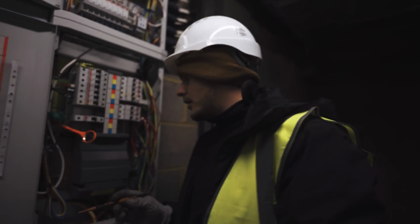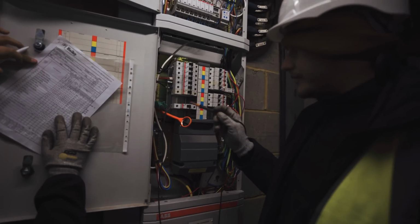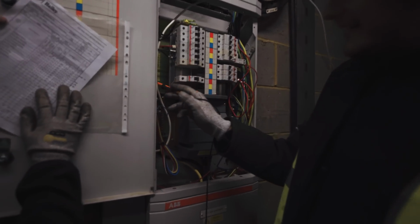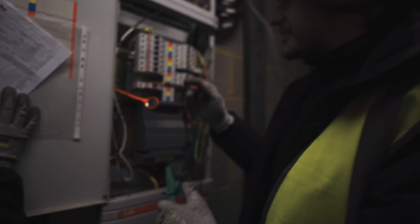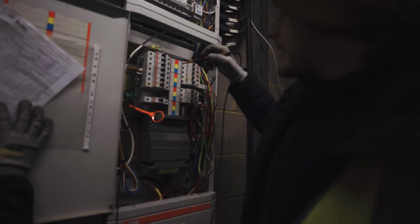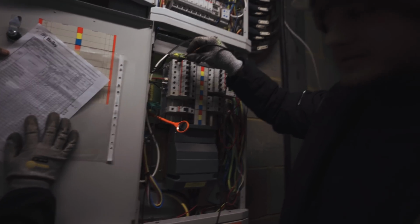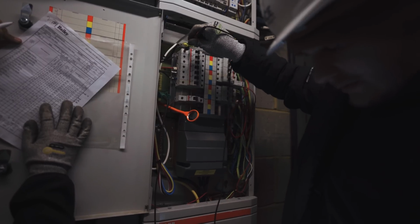For now, just to prove the cabling, I've isolated the board, I've disconnected the earth and wedged my mirror between it, because it's got a bit of pressure on it. It would touch the casing and basically give continuity still. So I've wedged that in there. I'm going to bang this on here. I'm just going to run through basically one by one. Not doing live to live because all the loads are connected, but live to earth, and see what we get.